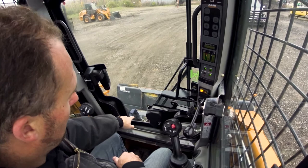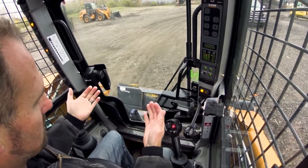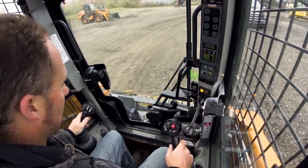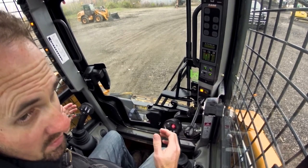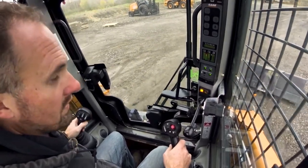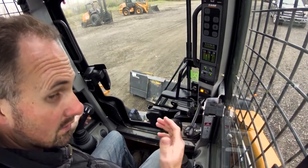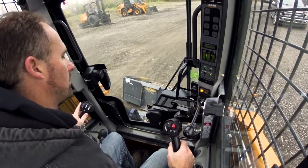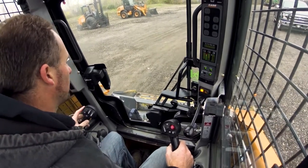My pin indicators are up — we're going to confirm they're all the way up and they are, so my pins are up and I can go into the bucket. Just fair warning: I'm nicely lined up straight in this particular instance, but that's not always going to be the case on a job. So let's set ourselves up for a funky situation — let's say we're coming into our bucket at an angle. You're never going to line up perfectly; it's a bucket, you've got a big powerful machine, shove it where you need it to be.